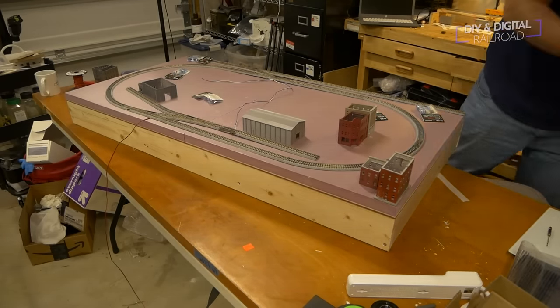I use two number 8 1-inch screws. I manually thread them through the holes on the Arduino Uno opposite the power connections. I then carefully drill them into the base. I then reattach the motor shield. Notice that I'm using a DC plug adapter on my motor shield. This makes plugging it in a lot easier. I will link these in the description below.